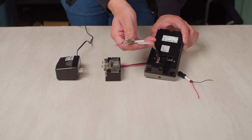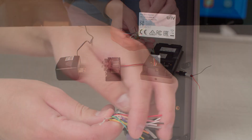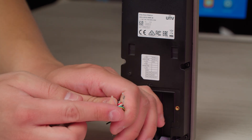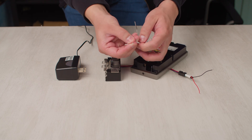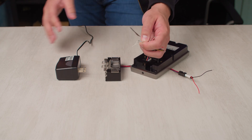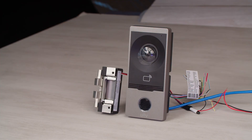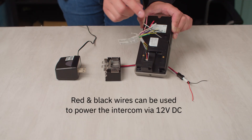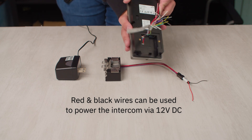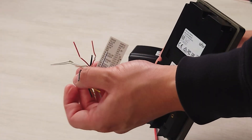Now that we have the wiring harness connected, you want to find two wires: the wire that's white with yellow stripes, as well as the one that's white with green stripes. Separate these two wires out because this is what we're going to use with the door strike. This intercom can be powered using PoE, like an ethernet cable, but if you don't have PoE, you can also use the red and the black wire to power it. If you're using DC power for the intercom, make sure you separate out the red and the black wire as well.